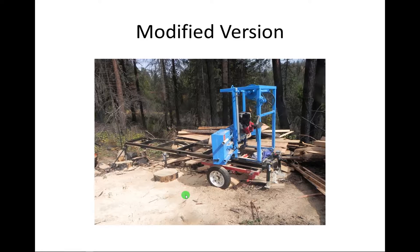Those jacks — you can buy them, trailer jacks, for about $25 a piece. It's worth the money because installation on pretty much any terrain is easy. As you can see, we just used stumps to level it. It takes literally five minutes and it's very easy to pick up and move to another location. I purchased this trailer from Harbor Freight — it runs about $200 and has a 1,200 lb capacity. The sawmill is 1,000 pounds, so it's perfectly suitable. We drove it from our house to the land on the highway and it handles perfectly fine. When the mill is moved all the way back, it's perfectly balanced. One person can lift the front of the frame and connect it to the hitch easily.